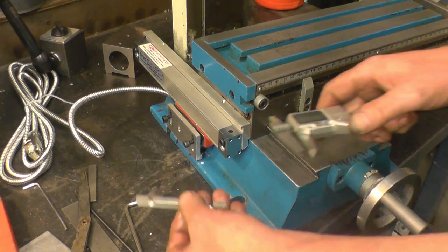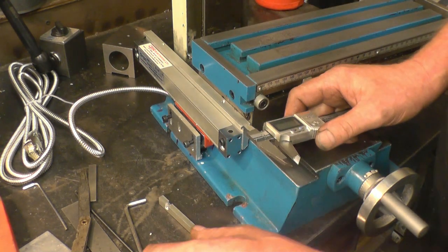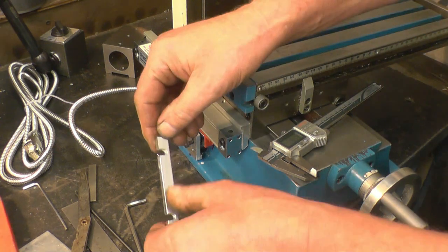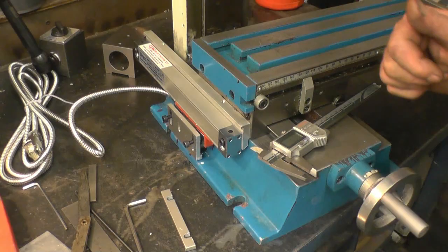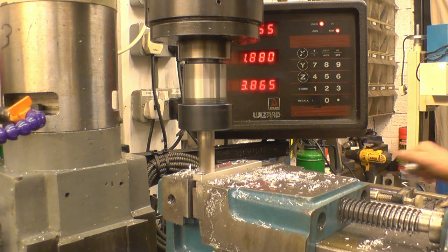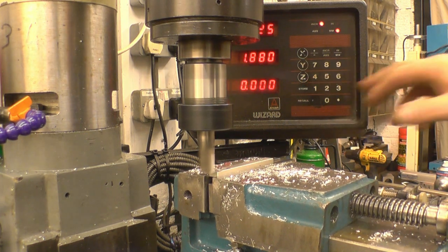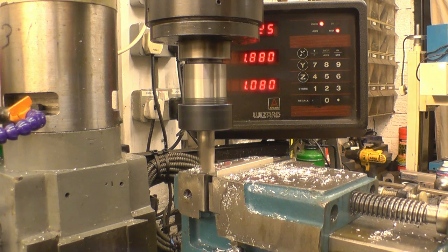0.3175 mil. What I have got is the piece I cut off the bracket, 5.93, so I can machine that down to 3.75. It's already got the two holes in, I just nip the ends off and that'll go in there, and then we're getting very near for a try. Just to touch this off. Zero, Z axis. Put a 1 mil cut on first.